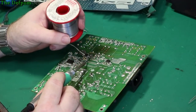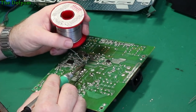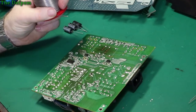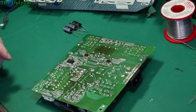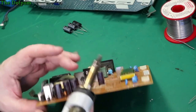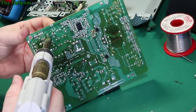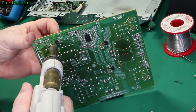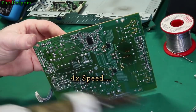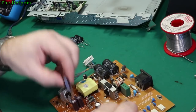I'll change that one as well because it's bound to go. I hate this bloody lead-free solder — the joints always look like crap. I should make a note of polarity, but it's marked on the board anyway. I always like to try and make a note — not like putting the cap in backwards. Those should all be the same value — 1000, 1000, 1000. Negative to negative.